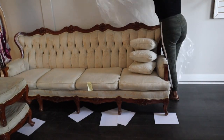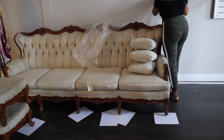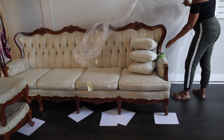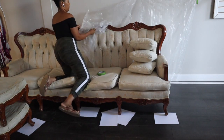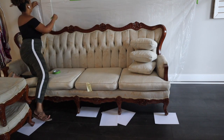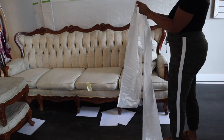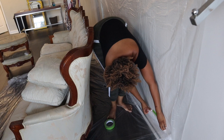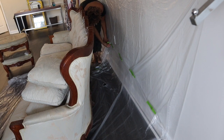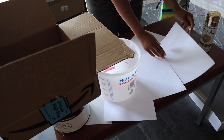Since I'm in my client's shop, I definitely wanted to make sure I protected their brand new floors and freshly painted walls. I'm taking some plastic I got from Lowe's and taping it to the walls and floors so that when I'm using my spray paint and chalk paint, I don't damage any of the client's surfaces. Taping things off can be a little tedious, but cleaning paint off walls and floors is worse, so definitely don't skip this step — especially when painting a large piece indoors.